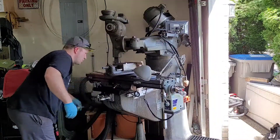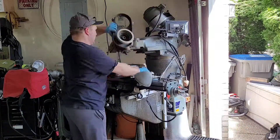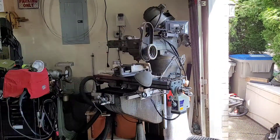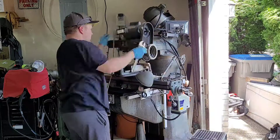This will also demonstrate how you can tilt these shapers. So if you have a slot that you need to cut at an angle, you can just loosen some bolts and tilt it — just like that. You could even cut at a 90-degree angle if you wanted to. Now I'm going to attach the motor to this thing; pretty easy, just a couple of bolts and throw the pulley cone on top.